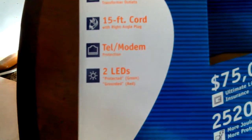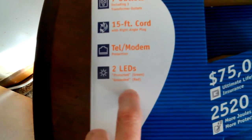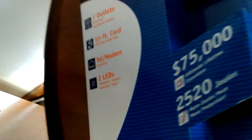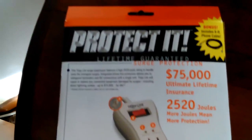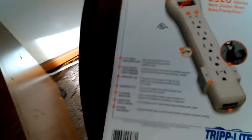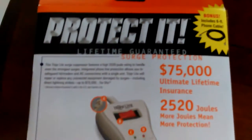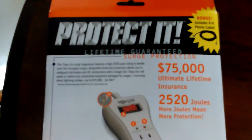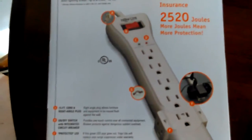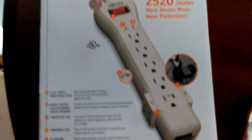It's supposed to help with noise. It has an LED that tells you when you're not grounded. But it's not that smart — I put a grounded plug in there, but our house is two-wire and the light is green, showing that it's grounded. But that just means there's something connected to the ground leg. I thought we'd be able to tell if the wire actually went to ground or not, but it can't. So don't let that kind of sensing be your tester — for sure.